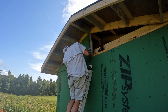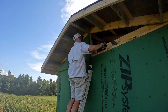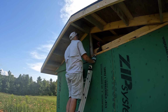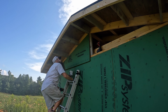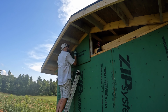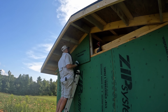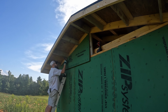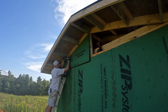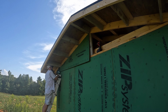I'm tacking this triangular piece of sheathing 3 inches below its intended destination because the blocks are in the way. I need to transfer lines so I know where to cut notches to fit around these blocks, but the blocks are slanted because of the 18.5 degree pitch. This means I have to use my level to transfer their locations perfectly vertically because I just need to slide this triangular piece straight up.